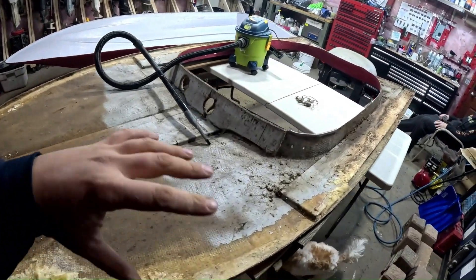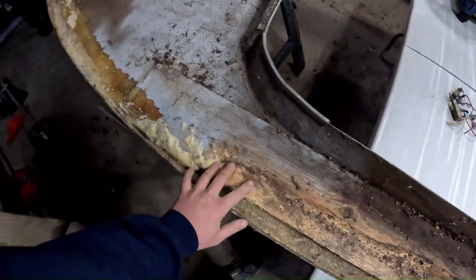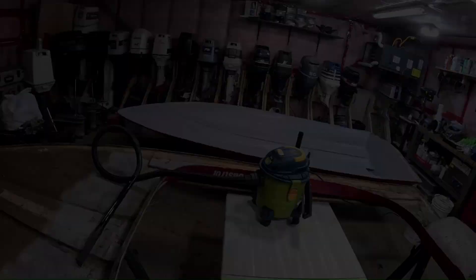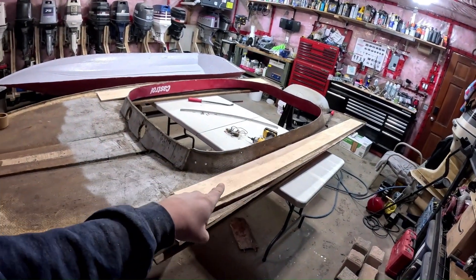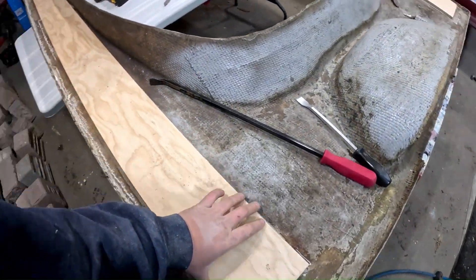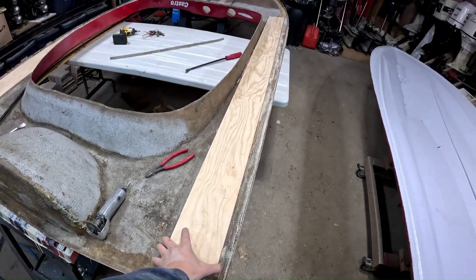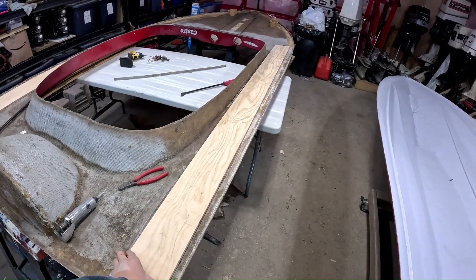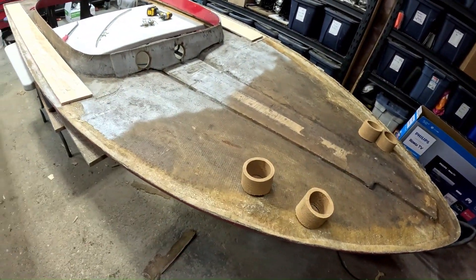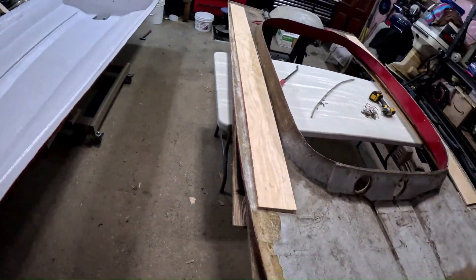Change of plans. We flipped the deck over just to clean the bottom side and we hadn't looked at it yet, and these deck supports are rotten. So we are going to cut these out and replace them and clean up the bottom of the deck before we drop it on. We got the old rotten supports cut out, everything's all cleaned up, and we got our new supports ready to epoxy into place. Then we will glass over top of them and get that back supported. Kind of forgot about the deck supports to be honest, but luckily the front one is nice and solid — it was just these side ones that were really bad. Get them replaced and then we can get it put back together.